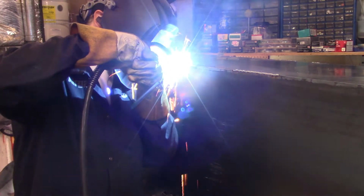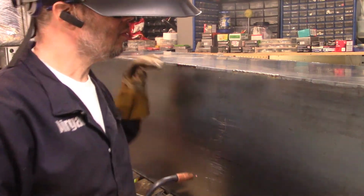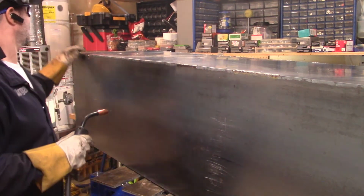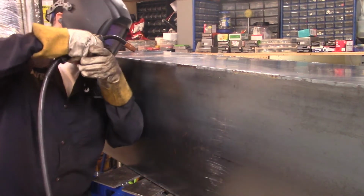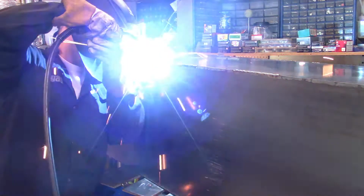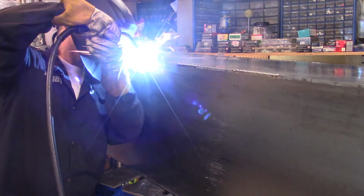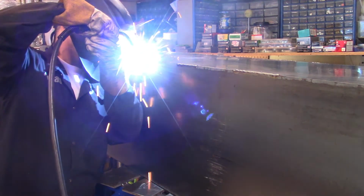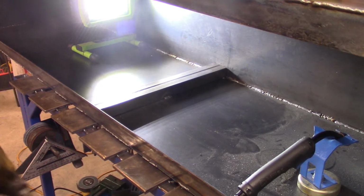When I did this job, I had my old grinder, and it's not very powerful, and I didn't have good enough flap discs to do the job with. So next time I'll know more about what to do. I went through a lot of discs just to grind down those welds. Next time I'm going to use a thicker, more coarse grinding wheel to grind the welds down, and then come back and use a flap disc to smooth it out. But again, I'm still sort of an amateur welder, and I'm learning the process. And jobs like this are so big, it's a hit and miss.